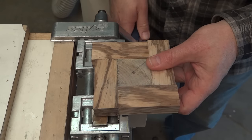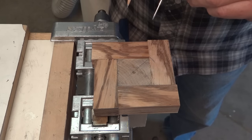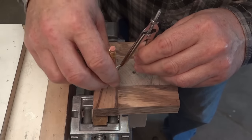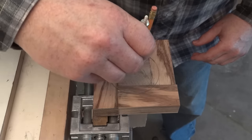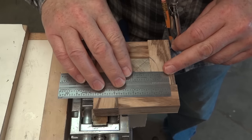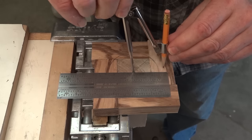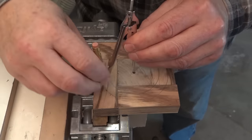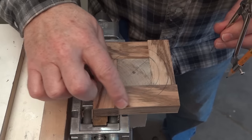My wife needs a two and three quarter inch hole for her hand to fit through comfortably and be small enough that the bracelet won't fall off readily. So I've adjusted this compass to one and three eighths of an inch, giving me the radius of one and three eighths, or a two and three quarter inch diameter. She also does not like large clunky jewelry, so I want a bracelet that's fairly thin — about a half inch thickness — and I can make it slimmer from there. I'll readjust this and draw that circle, then take this to my disc sander and sand it down just slightly proud of that line.